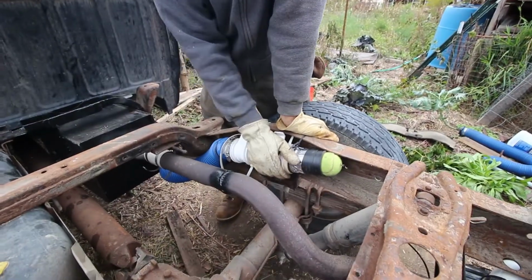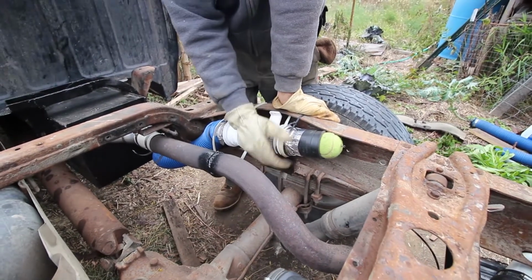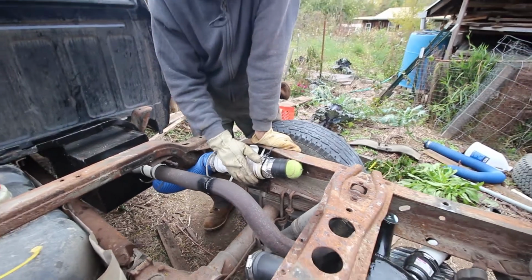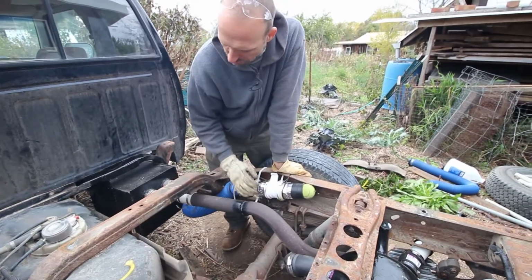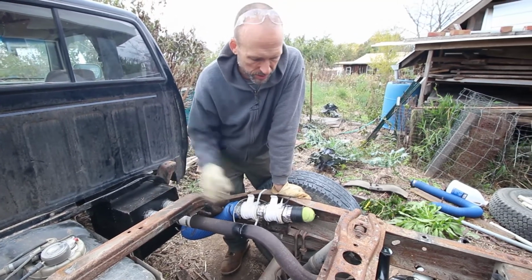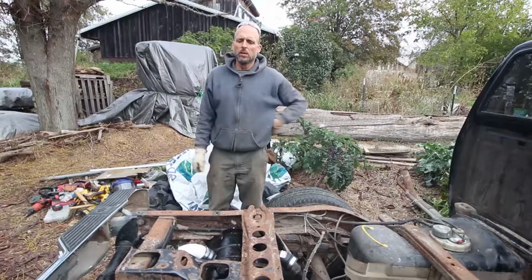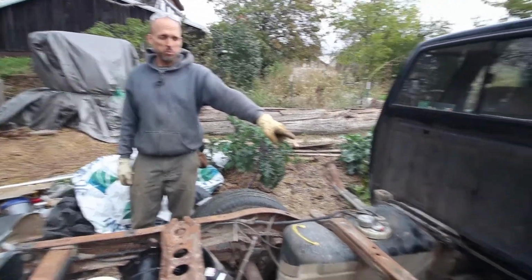These are two bilge pump blowers, which basically get gases out of the hulls of boats. It's a water-resistant 12-volt vacuum fan. And so we're using it here to force fresh air across our muffler heat exchanger to preheat the air before it enters the system. And this tennis ball valve here also allows us to shut off the fresh air intake if we need to. We finished most of the major components, including the muffler heat exchanger.